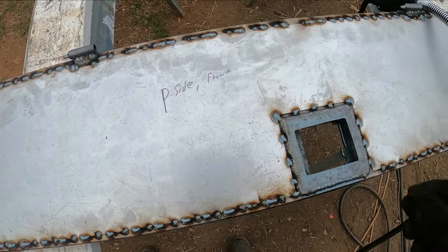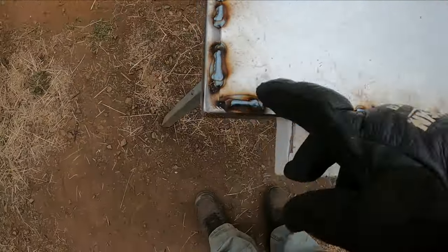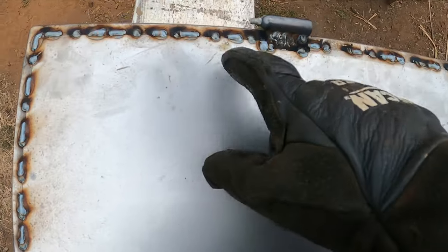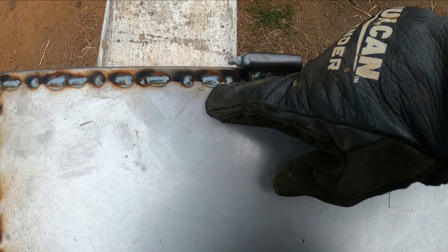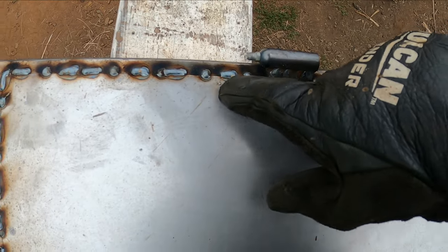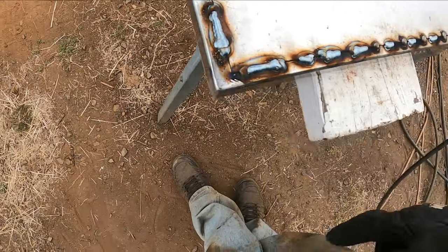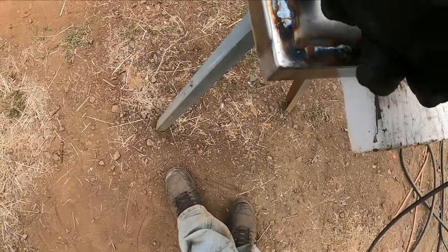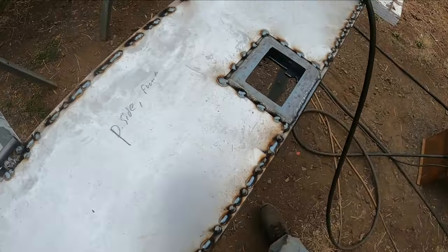Okay, I'm trying these with the tiny stitch welds, so like a quarter inch. There's like a double wide tack weld. I think I'm starting to realize what the problem is, and I'm kind of just wanting to close the gap. It's like right here if I'm wanting to stitch, but the tack weld is a little bit far, I just kind of want to finish the weld and I'm being impatient, so I'm still kind of doing it down here. This and this, I started at a tack and instead of stopping halfway, I just kind of wanted to finish to the next tack, but I think that's what's screwing me up, just being impatient.